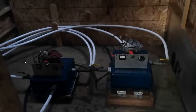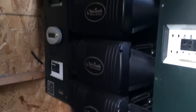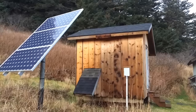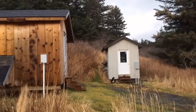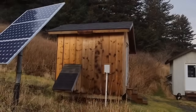When we turn the water on, those two alternators do nothing but charge our bank of batteries. We have four big batteries inside — each battery is a two-volt cell linked together to make up one battery, and we have four, so that's 48 volts of power. Those are inverted to AC power, which we use at the lodge, by these inverters. We also have three solar panels and a 12 kW diesel generator that are both largely backup. The majority of our power comes from the hydro plant, but the solar helps a little, and if we need it, the hydro system's computer will turn the generator on to also help charge the batteries so they don't get too low.